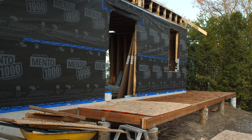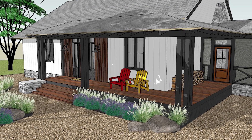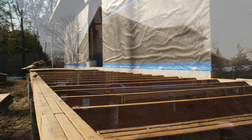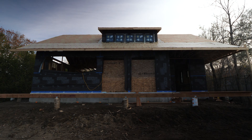For the wraparound, we're going to have a timber frame overhang that goes right around the corner of the house. They will be exposed, with tongue and groove on top. Right now we have the frame — the framing of the deck is already installed. That will carry the load of our 6x6 Douglas fir posts. And then on top of the posts, we're going to have a 6x10 beam that will transfer the load of the rafters, carrying right down to the Sonotubes.